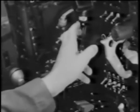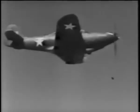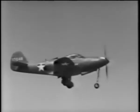Keep an eye on the indicators. When the wheels are fully extended, the pop-up indicator on the nose cowling and one in each wing panel will be visible. The travel indicator will be down and the ammeter should read normal.